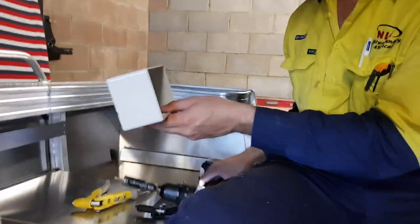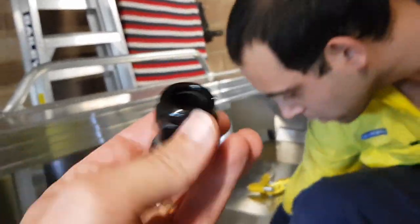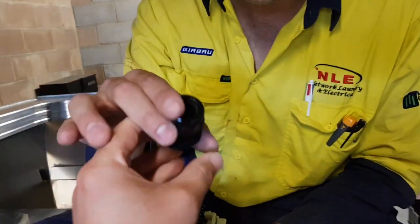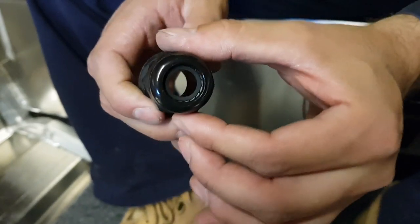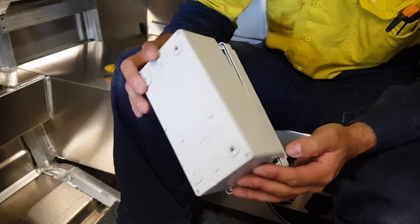To make it all nice, we're going to be putting one of these little grommets in — really cool. Frank, can you just turn that for the camera so they can see what happens when you put the cables through it? So when you put the cables through it, this is a rubber seal and it closes in as you can see, so we get a nice tight seal. That means I can pretty much hose the boat down no worries. This is our homemade waterproof switch box.